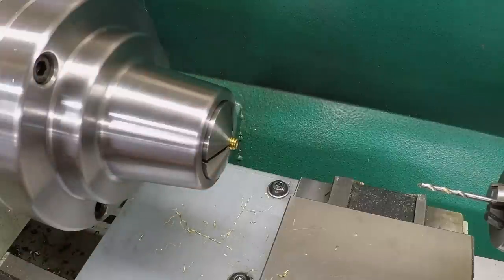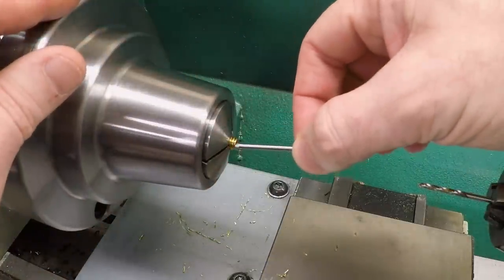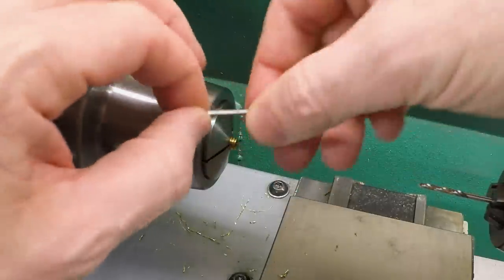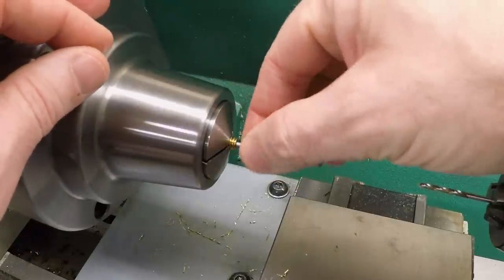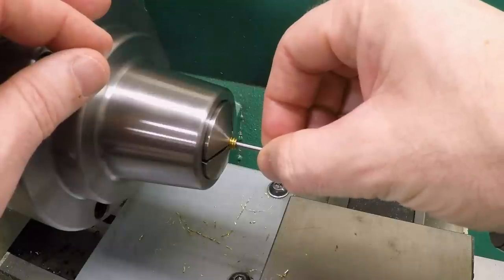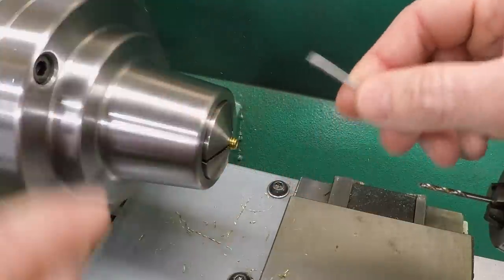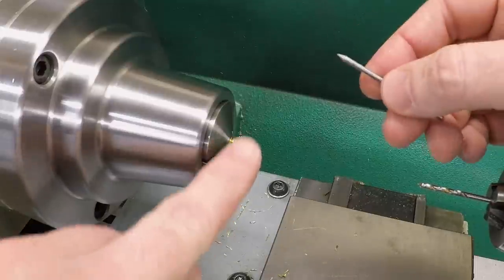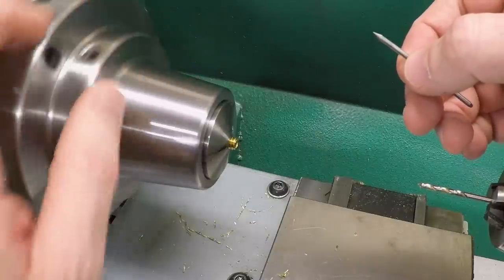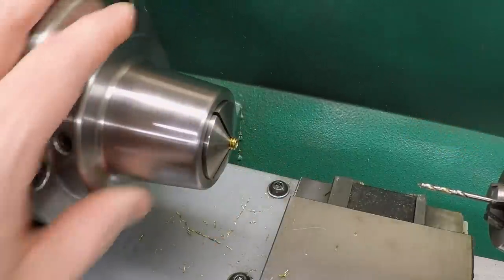That's that. You check the fit on the tungsten. I think I've got some chips in there. Yeah, that fits through. It's got a little bit of motion, not too bad. It'll be fine for grinding. So let me do 3 more of these, and then I'll do 4 for each of the other sizes that I want to grind. And then we can put this thing together.